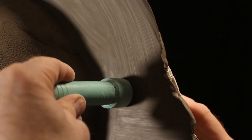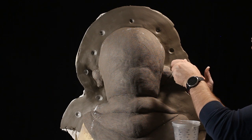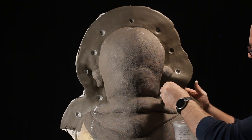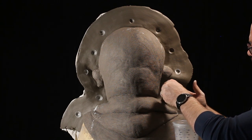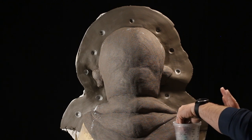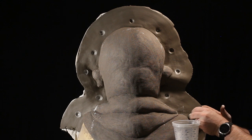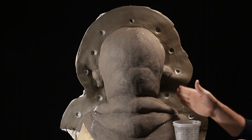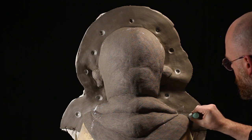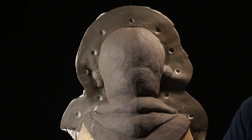The clay wall is done, so it's time to put the keys on. I've got a little joggle-making or key-making tool, and as you can see I'm powdering it each time I push it in. The powder helps it come away from the clay — otherwise you can get a suction effect that would break or damage the clay when you withdraw the tool. A bit of powder lubricates the edge without leaving any residue that could cause problems later.